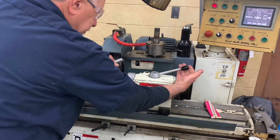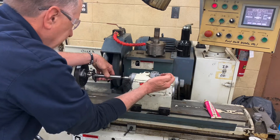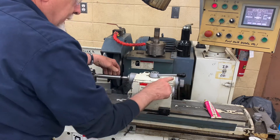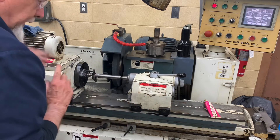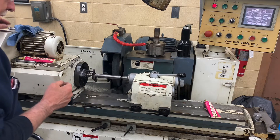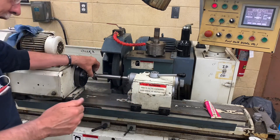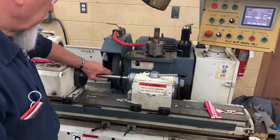If you have your part chucked up and the handle is right there with no pressure at all on it, that's not a good thing — we don't want our part flying out. So we pull it way back and load it. We may have to loosen these two screws here and move the foot stock forward and backward. In any case, we want this handle pointing about at this corner.